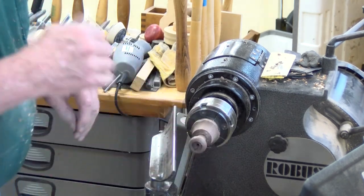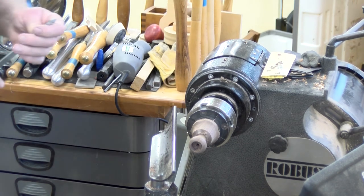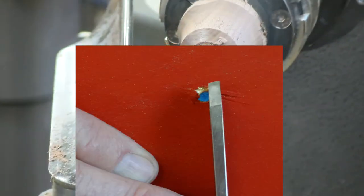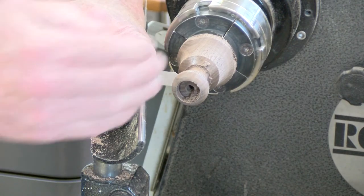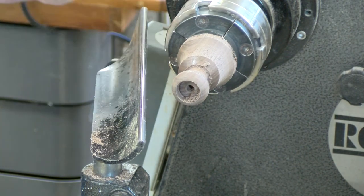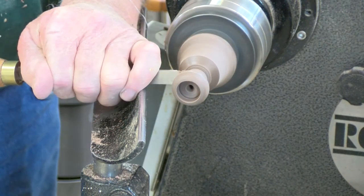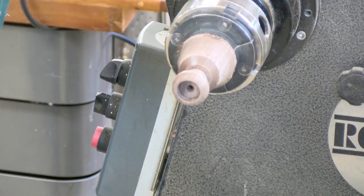Some little kid is going to be really happy with this one. Now I need to make an undercut where I'm going to cut it off. You can see the angle I've got on that tool — I cut this angle because I want to come in at an angle and make a slight undercut. I want the perimeter of the bottom of that knob to rest on the wood — if it were convex it would rock and not look good. I want it slightly concave. Let me just come in here a little ways before I sand it.